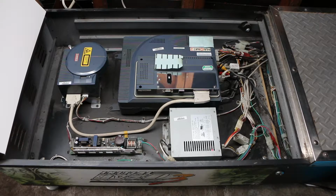on the GD-Rom. So depending on the game you want to play, you may need a GD-Rom to use it, and this NetDim board that's slotted in there is what allows the main Naomi motherboard to interface with it. Also, you'll note that this Naomi motherboard is navy blue, which means it's a Naomi 2. This unit is really only necessary for a few games, including Initial D. Most of the Naomi motherboards are white, and you don't need this Naomi 2 to play them.